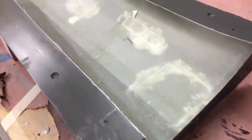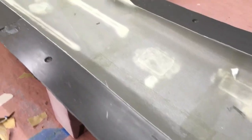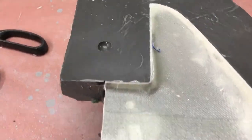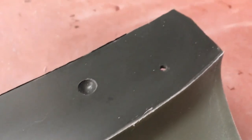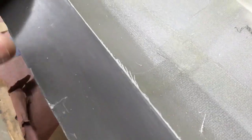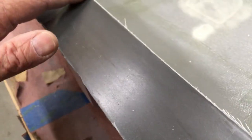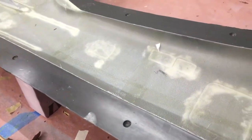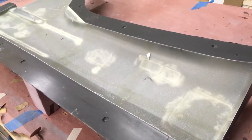The rear end molds are all trimmed up and everything's pretty good. All we're doing is basically flushing to the surface of the parting plane and that's about it. You just feel if it's fairly flush — if it's not, just re-trim it a little bit. So that's the rear end done, ready for prep for joining.